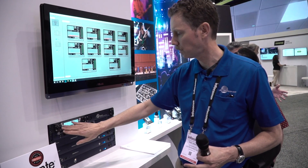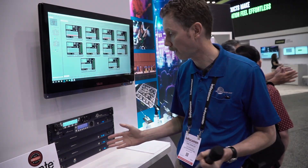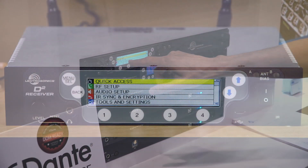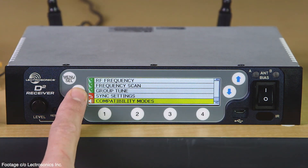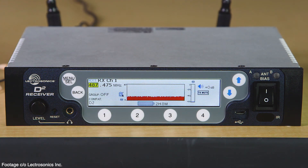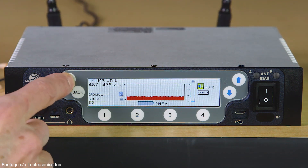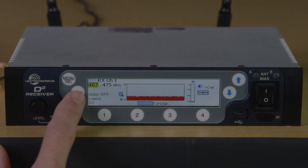Overall rack compactness: four channels in a half rack space gives you up to eight channels in one rack space — that's double the density of pretty much anything else out there. The menu structure is designed to be very user-friendly with color-coded areas as well as a quick access menu giving you a quick look at most of the stuff you're going to change all the time. There's also a channel detail view — push the channel one button and you can see the frequency, ten seconds of history, audio level, mute status, compatibility mode, and more.